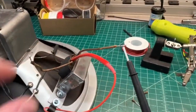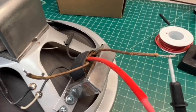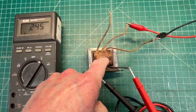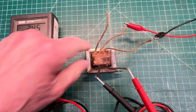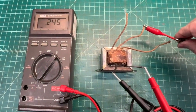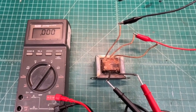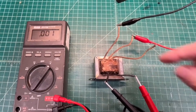This thing would have probably failed soon as B-plus voltage would have been applied across the primary. But a bummer, because you can see I've got the secondary tied in. Murphy's Law came into play. I've got the output transformer — I had it actually connected to the loudspeaker, as you can see — and one side of the primary is open. This is the good side; center tap back, and you can see my voltage switch leads. I just had checked DC resistance and everything was looking good. Glad it failed now. I'm going to pop this thing apart.